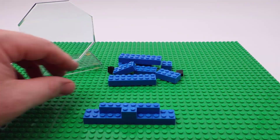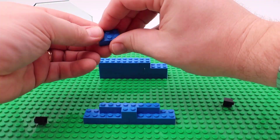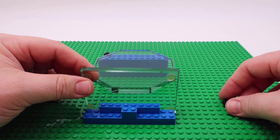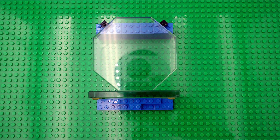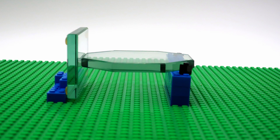This laser hack will use Lego blocks to produce a stable, consistent custom platform to hold these kinds of objects in place when laser processing for quick, low-volume repeatability. All you need to do is take the blank product or object that the fixture will be needed for, place it onto a Lego base plate, then take some Lego blocks and build around the object so that the part fits into a custom-built template.